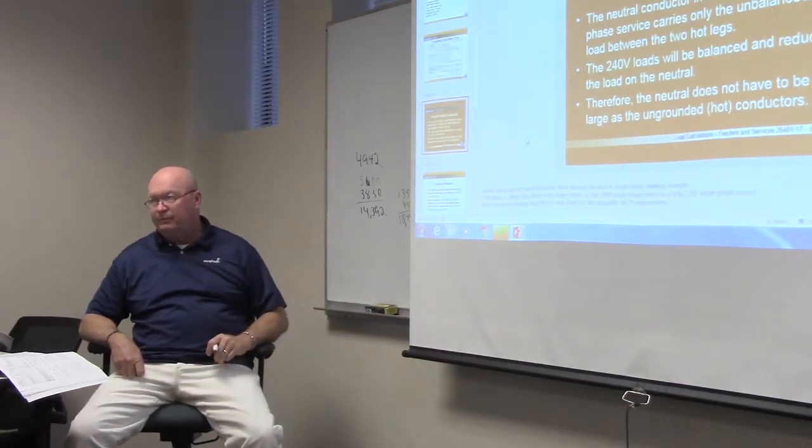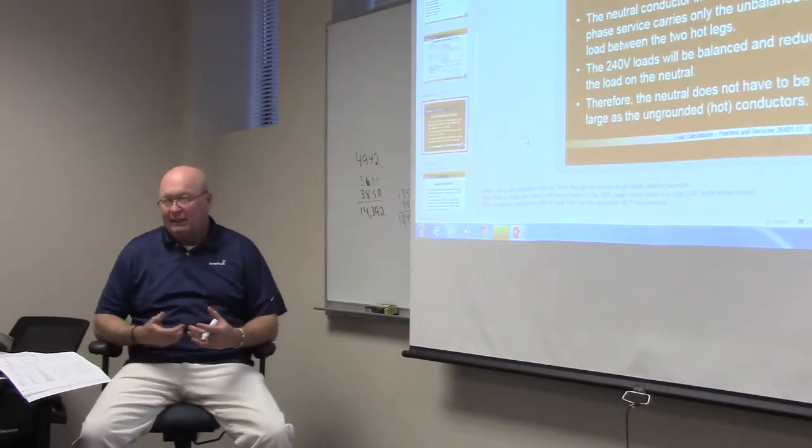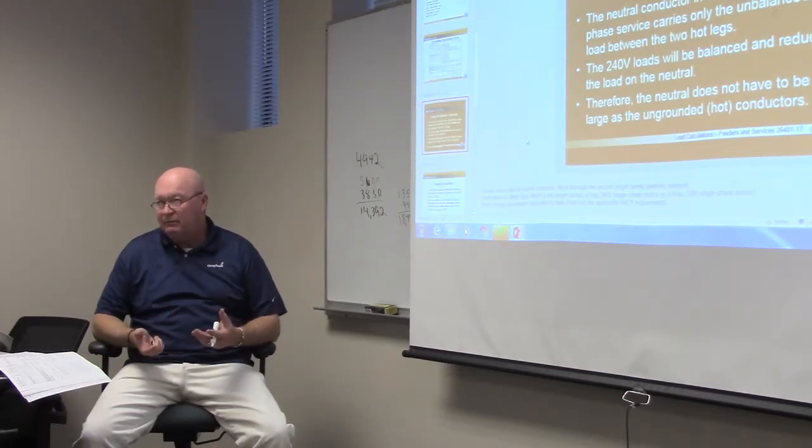Make sense? That's why when you buy a wire, like an SE cable or something like that, USE for a house, and it's aluminum, you always notice what? The neutral's a reduced size, isn't it, when you buy it? And they've already calculated that in. And so that's the reason for that.